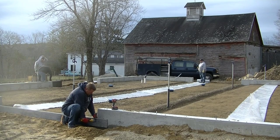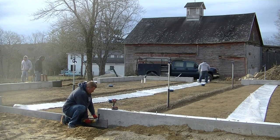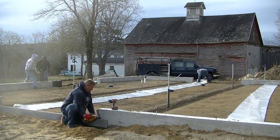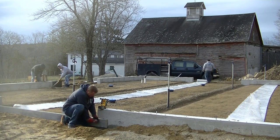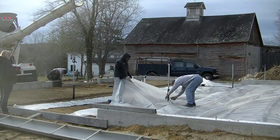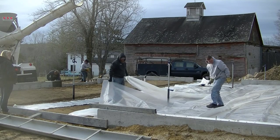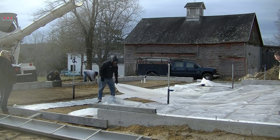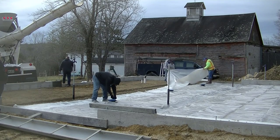What we're doing right here is getting the floor ready just before the concrete shows up. Luke's putting the forms on. We've got my favorite DeWalt battery hammer drill right there — that thing's great. He's screwing a hole and then we use a Tapcon screw to fasten the forms on. Usually I get here the day before to get all this ready, but we've been so busy lately we couldn't, so we're here at 5:30 this morning getting the forms on, putting the poly down, and making sure everything is ready to pour.